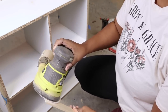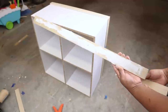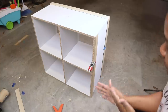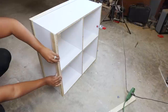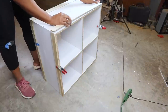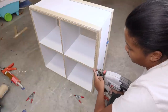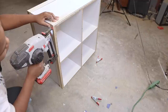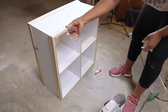Before attaching them I sanded the pieces down with 220-grit, smoothing out certain areas. Then I used liquid nails — you can use liquid nails or wood glue to attach the pieces. Once the cuts are done, it's easy: apply the adhesive, smooth it out, add it to your piece. I also used small clamps to hold pieces in place, then used three-quarter-inch brad nails to attach everything. When using a nail gun, nail in the areas where the particle board attaches to each other — you honestly don't need many nails.